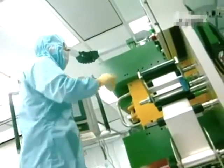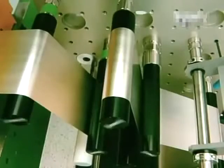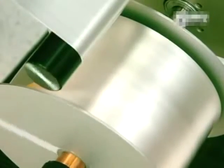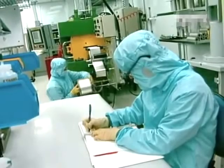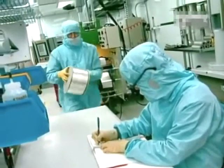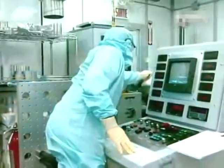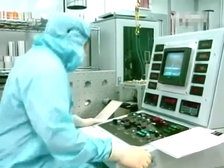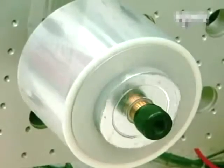The sheet has to be further thinned. Placed on a roller, it's carried to the laminator, where at room temperature it's thinned once again. In just 20 minutes, the 5 kilo ingot will have been transformed into a thin sheet 200 meters in length. This laminator completes the thinning of the sheet to between 20 and 40 microns. The resulting 2 kilometer long sheet will go into making 210 battery units.